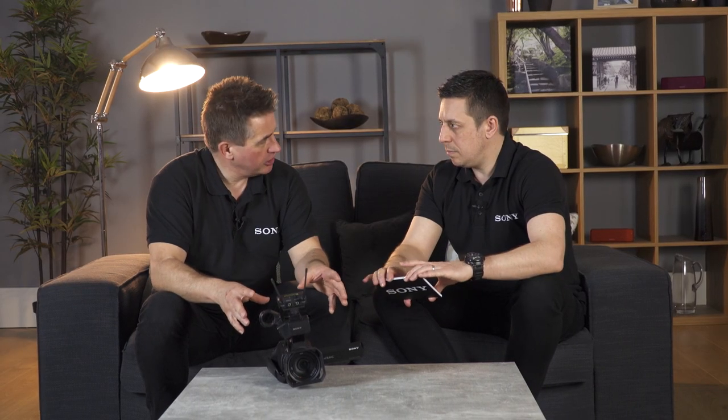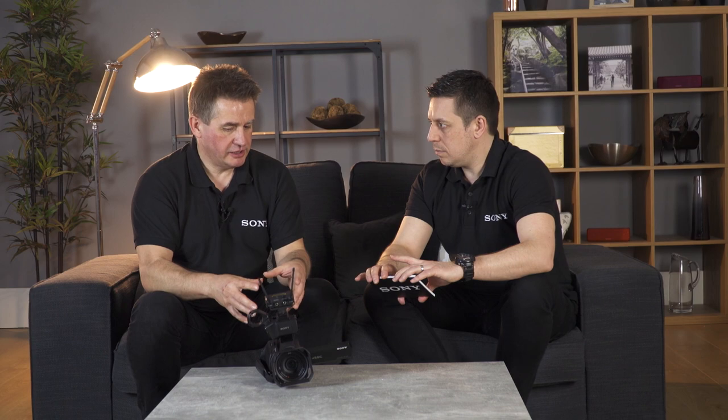This is a very professional camera and it is being used in new scenarios. One thing we've put into this is the ability to stream to our XD Cam Air, so we have a very high-end delivery system for news and broadcast. It also comes with a Ustream ability so we can stream to the Ustream platform. Additionally, it can provide a UDP stream where we can allocate an IP address and a port to stream to a standalone server or something like VLC where people can view and use that stream.